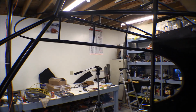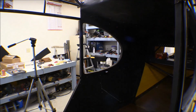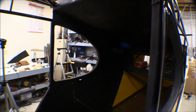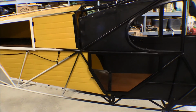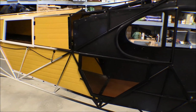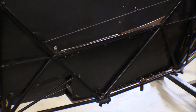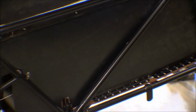Cut plates are all installed there on that door header. Got those in yesterday. I've got to take these side panels out to trim them up. I've got that one all installed. I found all of the screw holes, the mounting holes and stuff in them, and got screws in them. I need to trim that up. I've got the right side pretty well trimmed out. I cut out around the baggage compartment, trimmed it all up for the lower panel plus the upper panel, mated them together. I put some kick panels or brackets down there on the floorboards to keep the panels from moving around too much, from flopping around down at the bottom, both front and in the middle here.